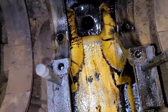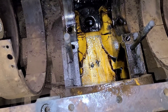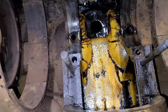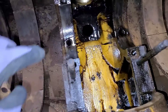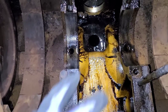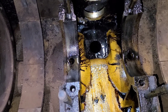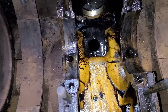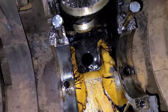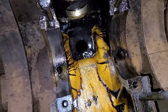I'm not terribly concerned about cleaning these all that well right now. This whole rear casting is going to be pressure washed. Some of you are probably going to ask why I'm going to pressure wash it if I'm sending it out to sandblast. Here's the reason: any of these holes — anything that has oil in it — is going to attract that sand. We're not going to blast in here, but that stuff still gets everywhere. So anywhere there's oil, it's going to be a pain to get the sand back out of stuck oil. Whereas if I pressure wash it clean first and then have it sandblasted, it'll be a lot easier to get that sand out after the whole sandblasting process.